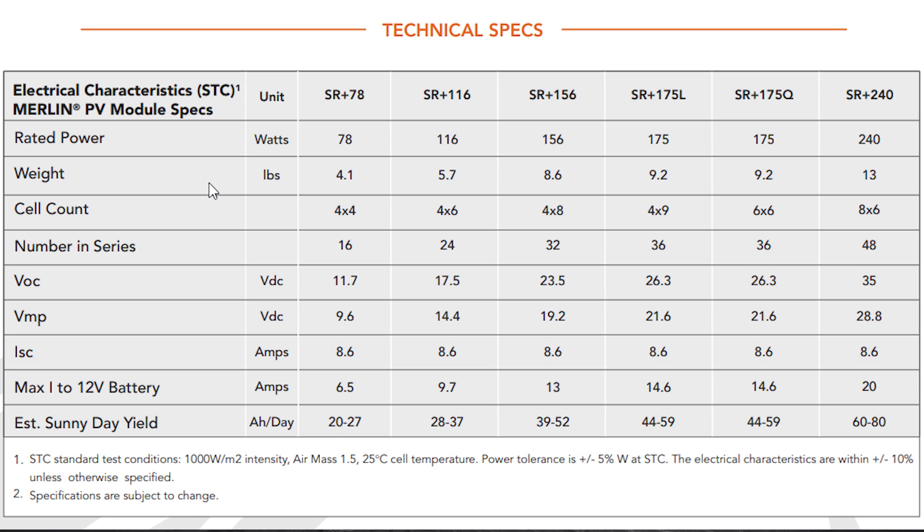The other thing to remember is if you wire with a high input voltage, your input current might be lower — because in series, the voltage is added but the current stays the same. But that is all going to get translated, i.e., converted, to your battery voltage.